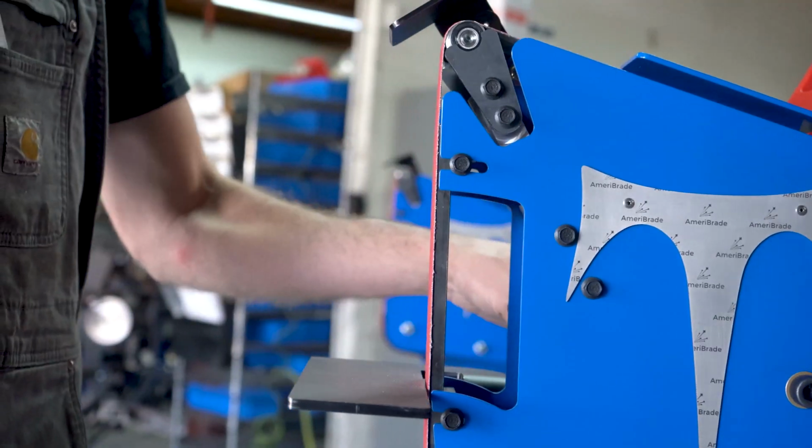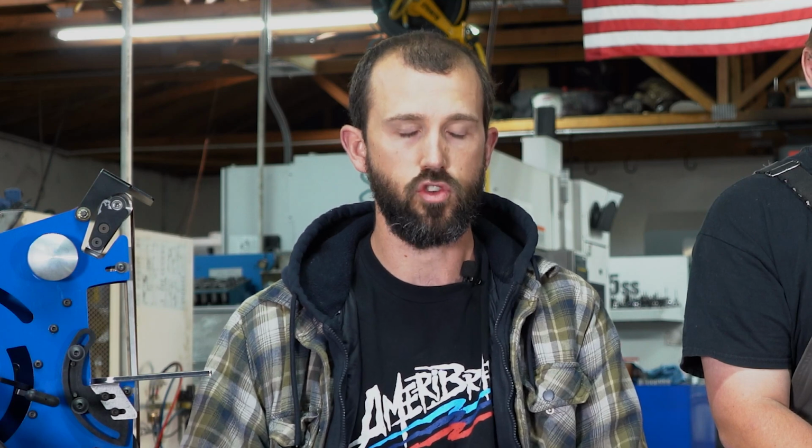Super fast to go from coarse grits and roughing all the way up to your fine grits for polishing, and you can even throw on a leather belt, and since this will run in reverse with the variable speed option and track well in reverse, you can sharpen on that leather strop.